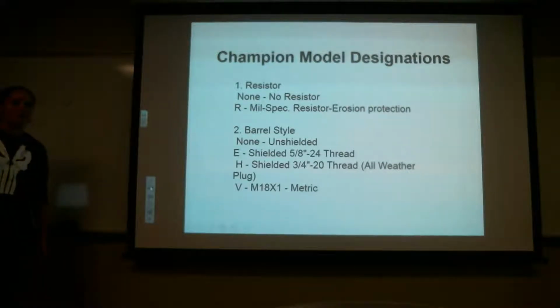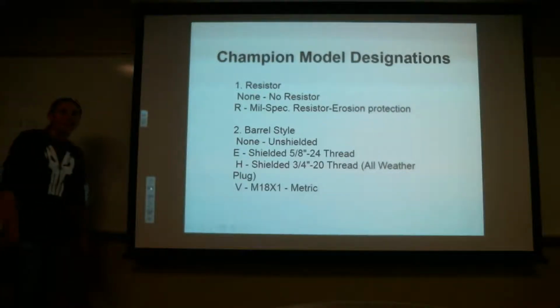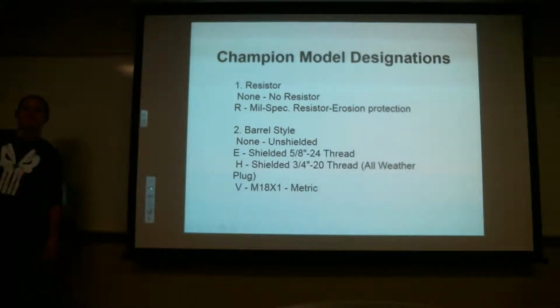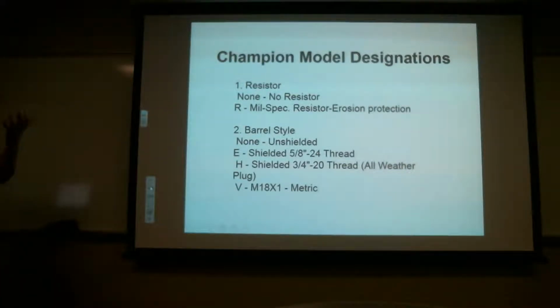That's what you're basically saying then, right? Thread pitch, yeah. It's like 20 threads. Okay, so yeah, it's basically what he's saying. No, it's not what he's saying. What is he saying? He's saying threads per millimeter. He's saying the thread spacing is 1 millimeter. Do you see the difference? Yes. So between each thread, you're telling me it's 1 millimeter, from the peak of one to the peak of the other, or valley to valley. You see how different that is.